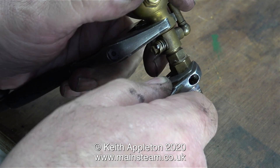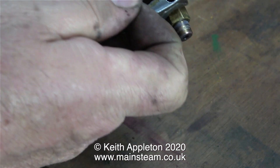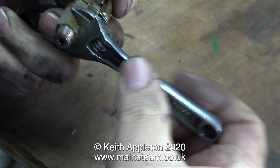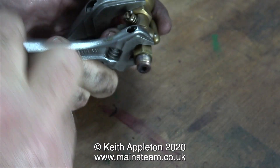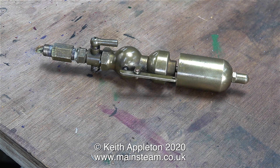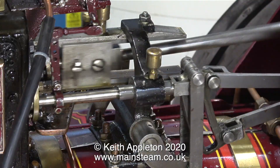This object that I'm working on is the whistle. I don't like this whistle much at all — I'm only interested in the adapter. This original whistle will go into my box of original whistles off old traction engines. The adapter is a 3/8 by 40 threads per inch adapter to 1/8 BSP. I screwed a fitting into it to allow me to connect my airline.